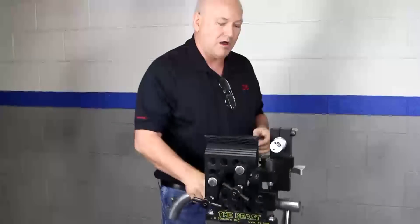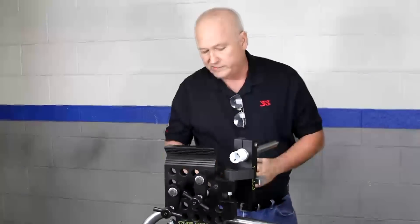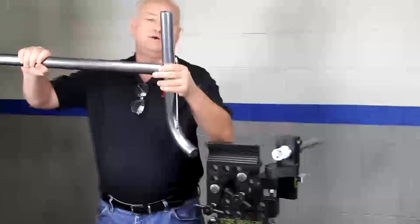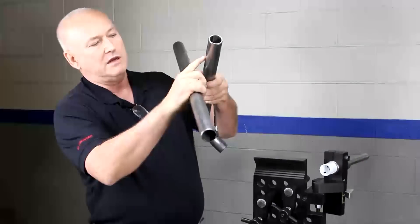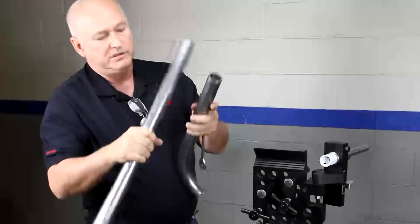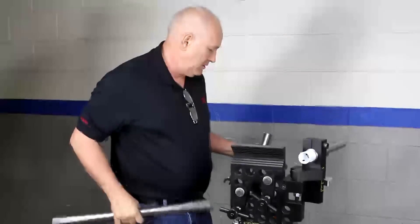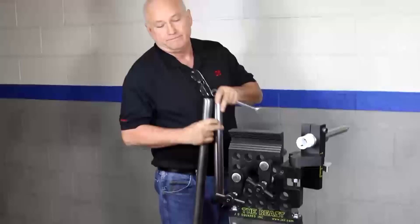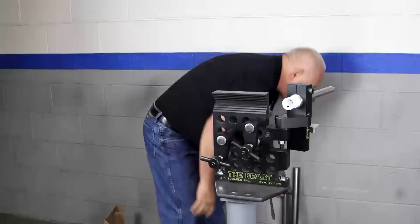She's also got the ability to offset notch, and this is very popular with your sprint car guys. A little-known fact is that if you notch a piece, tube it, and put it together — that's the way most people do it. However, if you take a half-partial notch out of the top and lay the other tube in it like you'd build Lincoln Logs, then weld it up, you get about a 30% stronger joint. You'll see that a lot in sprint cars because they're going for the ultimate lightweight frame and need the strongest possible notches. This machine will handle that.